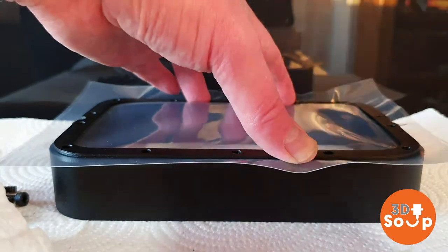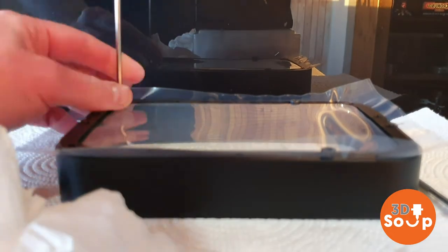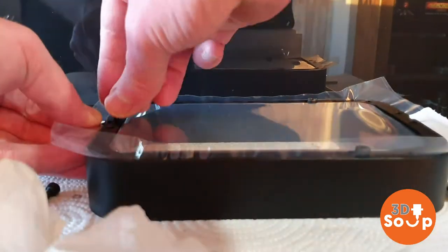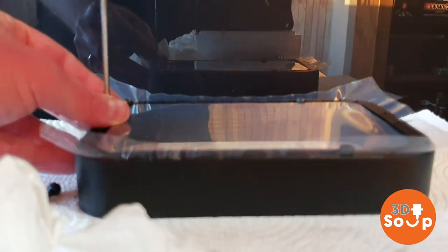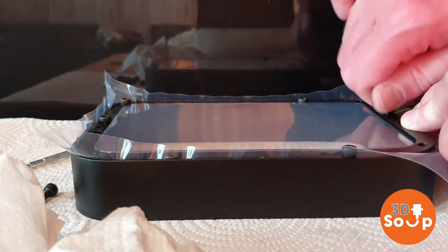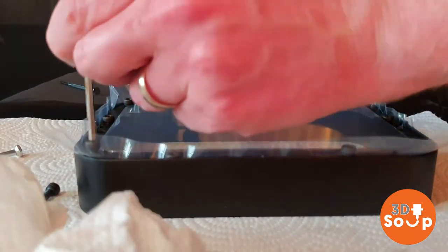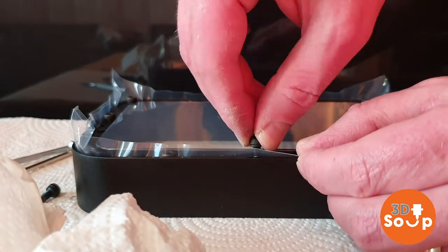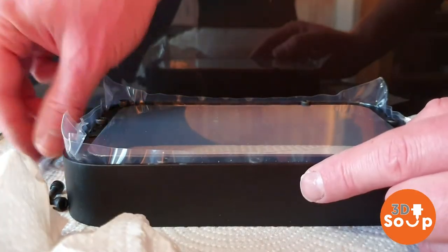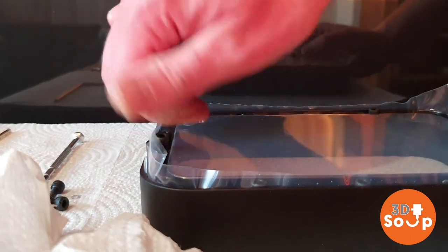A little note: you'll see that I have not cut off any of the excess film. What I like to do is put it tight all the way around so I've got a good little lip on the edge I can pull and keep it nice and taut. Once I've attached all the screws, I'll then get a sharp knife and shoot around the edge to cut it off. Some people like to cut it to size first, but I find having that extra lip gives you a really good amount of film to grip and pull to keep it workable.